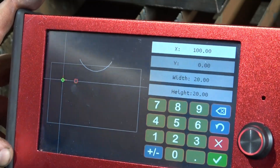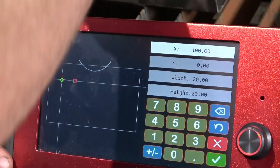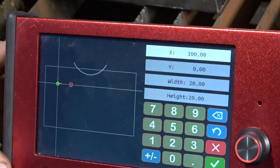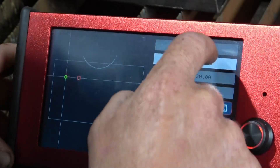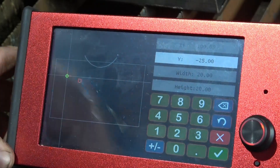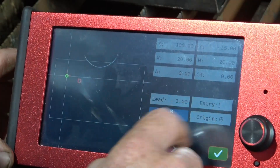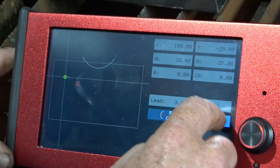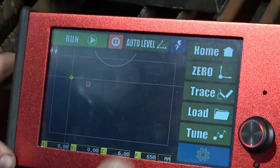We want it central, so just click 100 - the torch is referenced on the corner of that box. That's your reference. So now I need that torch to cut center 100mm down. That box section there is 55mm, so we want minus 25 - 25mm. So now that should line up center. We want an inside cut, right cut, 3mm lead-in.